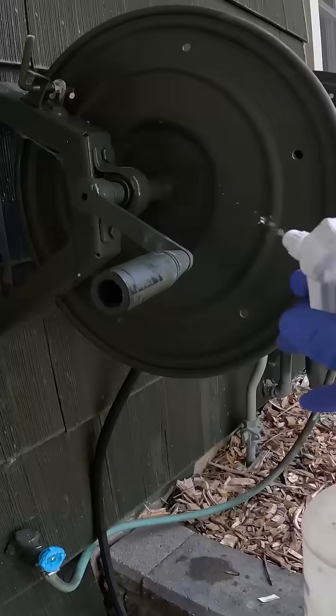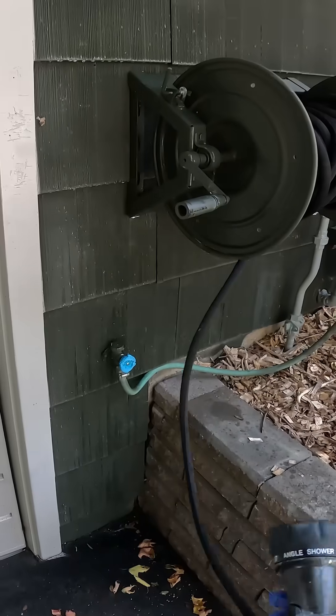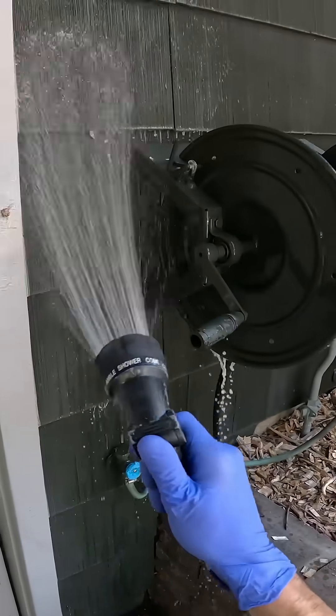We've run out our experiment. Let's go power wash the house and get rid of some spiders. Now we've proven that a 5% SH mixture is what we need. For small areas, you can just mix a 5% mixture with a couple drops of laundry detergent in a spray bottle, apply it to small areas, and after five minutes just rinse it off with a garden hose.